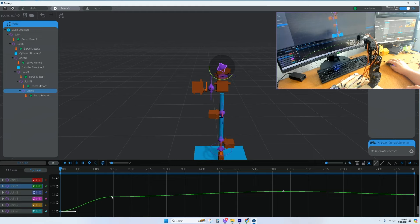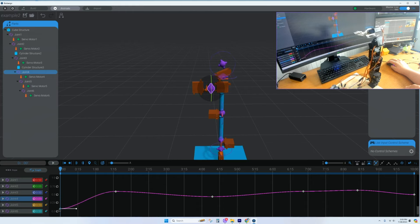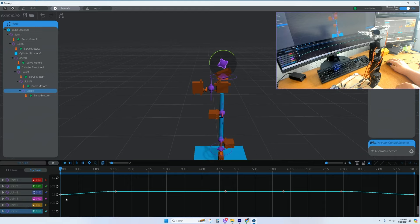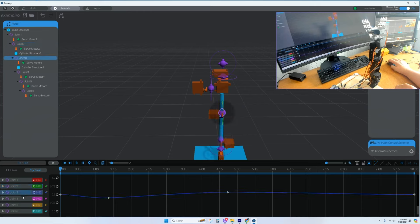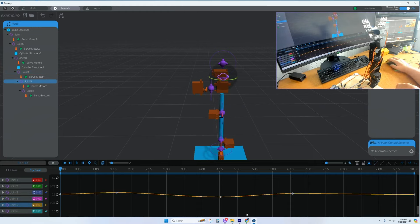Repeat this calibration for each motor — for example, Motor 4 needs to be straightened up. Type in the desired PWM value (e.g., 642), click the joint, then 'Use motor's home at zero' and 'Fix mismatch for me.' For the gripper joint, I set it at 1046 so it's open enough to grasp something but not excessively wide. Set all joints to zero as their home positions.